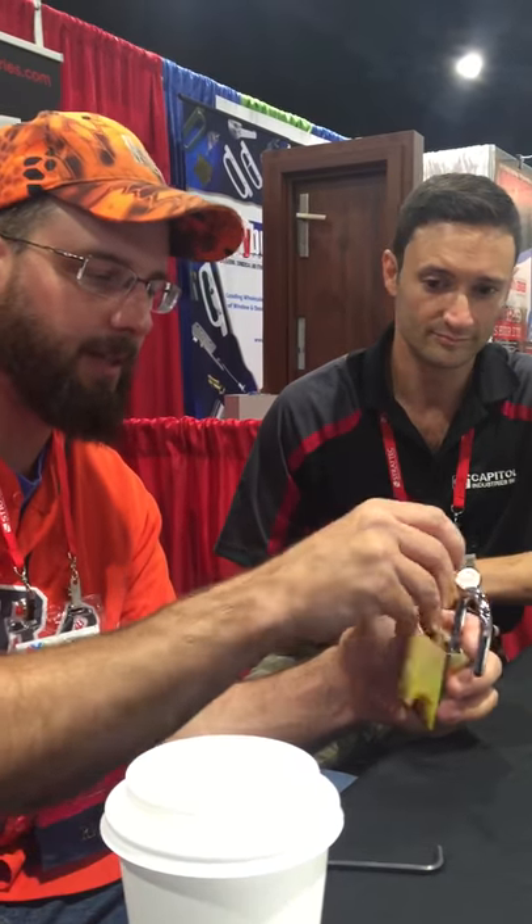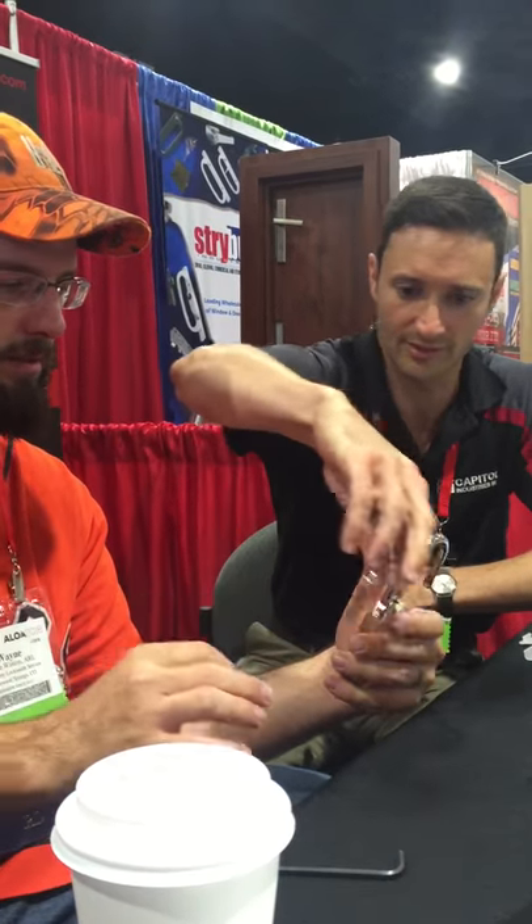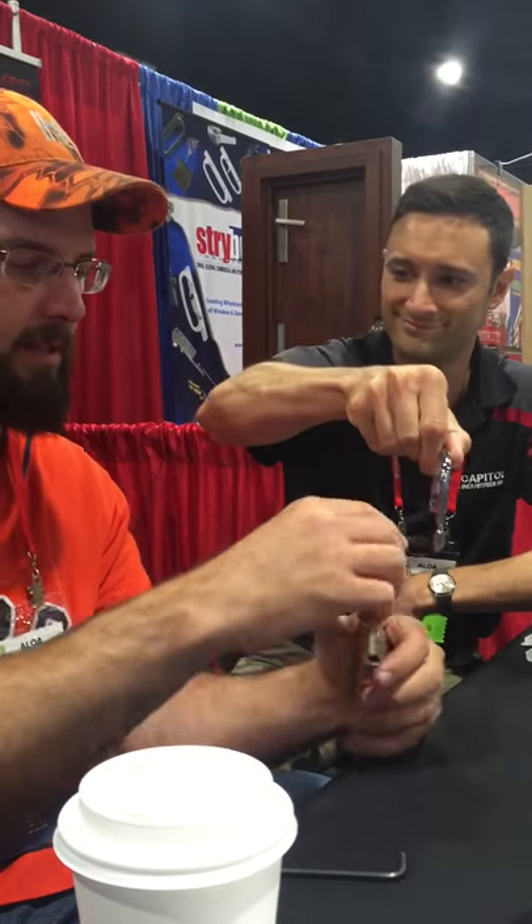So you're going to need the key. You're going to pop the lock open. There's going to be screws down in the bottom, just like a typical padlock. We're actually going to take this and get this open here. And then we have another shackle, and this is actually kind of a change key tool. You can't service this without this other piece. So we're going to put that in there. That's going to come out, and then that's going to give me access to this side.